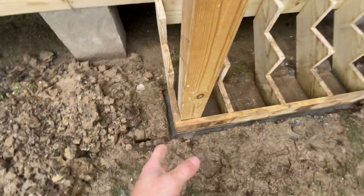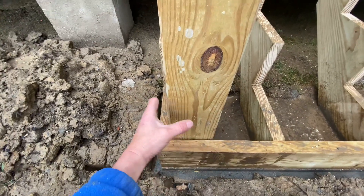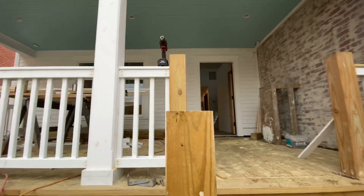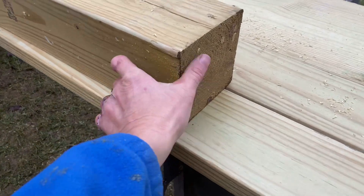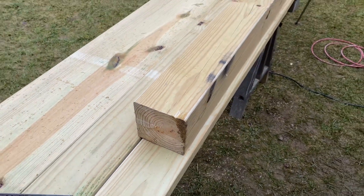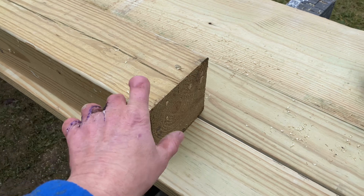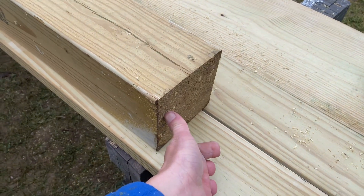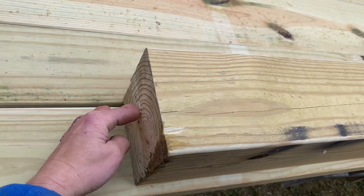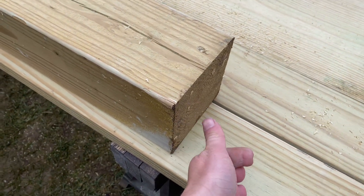Check out this post right here. This is basically where it's going to sit, but I don't want it to sit fully inside these two pieces. So I'm going to cut around this on two sides, take out an inch and a half in both directions, and it will slide out and square up with this outside corner — perfectly in line with my post above. Pro tip my dad taught me: this pressure treated post has a factory end on one side and a cut end on the other. Since one end is going into the ground, always put the factory cut end on the ground — it has had more treatment absorbed through the end grain than the middle of the post where treatment had to soak in from the faces.